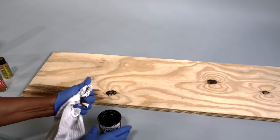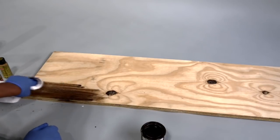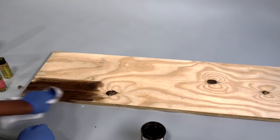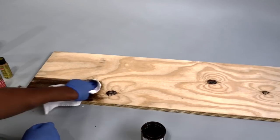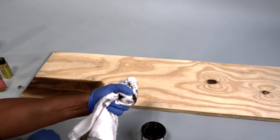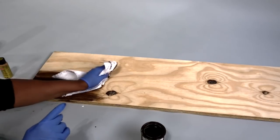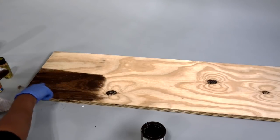I'm applying a little more stain, wringing it out with the cloth so not too much goes on the wood. Look at that grain coming through — it's really pretty. You can also apply multiple coats: if you want a really deep dark espresso, do one coat and come back with another. You can see me dabbing, wiping, dabbing, wiping — you can really see the beautiful rich light and dark tones in this wood.